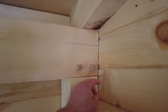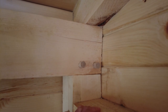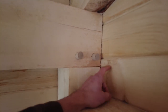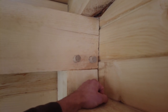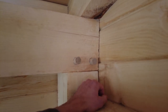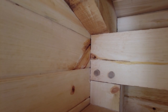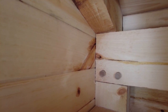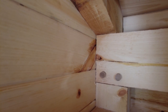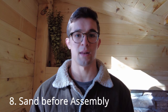In hindsight I would have just notched out a three-quarter inch thick channel running parallel with the outside face of the timber, and then the tongue and groove would have fit right into that with a bearing surface. What I ended up doing instead was assembling all the tongue and groove pine up to that point and then using a three-quarter inch drill bit — and I don't know why I didn't realize at the time it would be seen on the inside. This side actually came out pretty well with a nice straight vertical cut, and you can't see it but it's a three-quarter inch wide channel that lets those boards bear on something rather than just stopping with nothing to screw into.